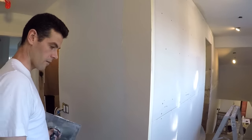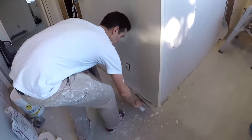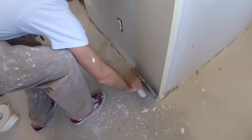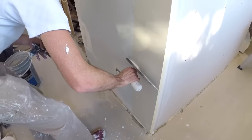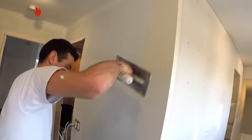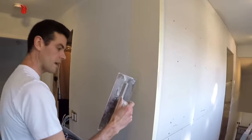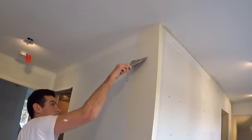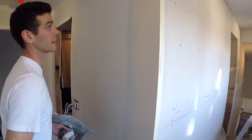So now I've got this loaded. The next thing I'm going to do is a feathering pass real quick. I'm pressing really hard against right here and I'm not taking any of this stuff out — what I'm doing is just feathering this edge. You can see it's leaving a lift-off right here. If that is too challenging for you at first, you can also just use a 6-inch knife and feather that edge just like so.